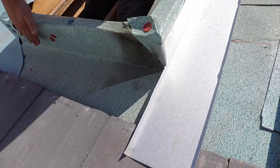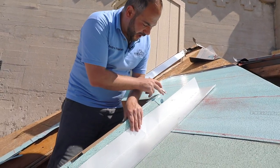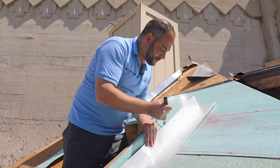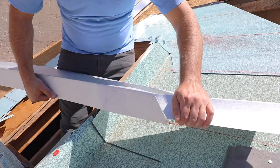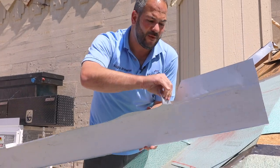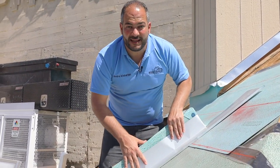On this top side, we also have to fabricate this flashing. I'm going to mark out where our top wall stops, then cut it at a 45-degree angle and bend it down. We want to do that so that it ties together with our saddle that we're going to install on the top side. You can see we've made a 45-degree cut, and once I put that into place I'm going to bend it in the directions I want it to go. This is going to be sitting on the top side of that saddle wall, and the saddle will come sit on top of here. There you go — we have our tile pan cut and ready to install.